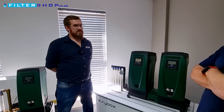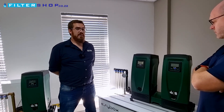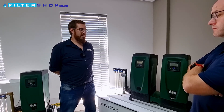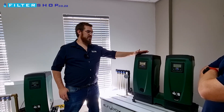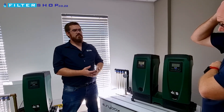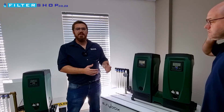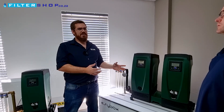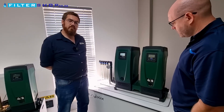You're going to get a lot of errors — this unit is very good at protecting itself, so you'll get a lot of dry run errors. The pump itself will be okay. With a lot of standard pumps you don't get those errors, but that doesn't mean they're not suffering — they're just suffering in silence. This one will tell you there's a problem.